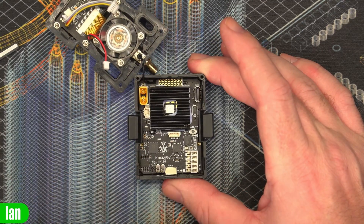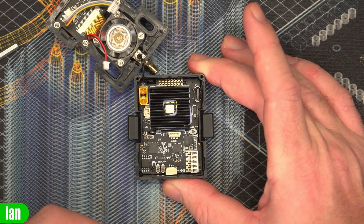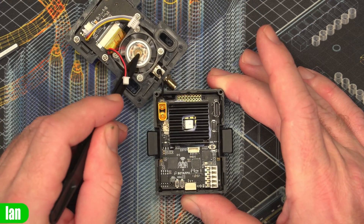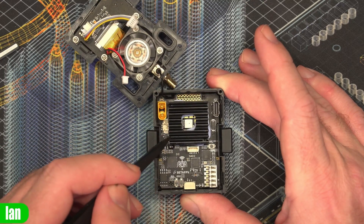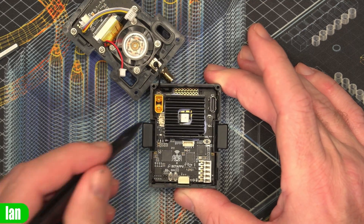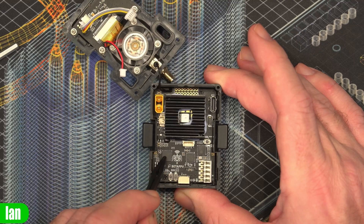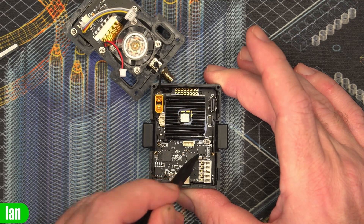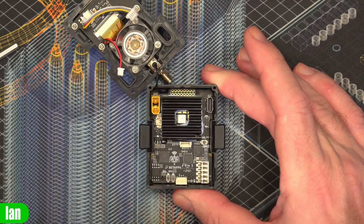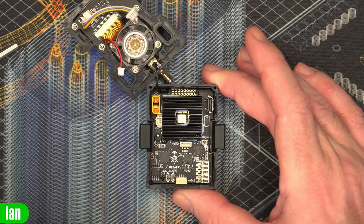The big difference on this module compared to the original is the large heatsink. Because it has up to one watt of output, they're having to get rid of additional heat, so they've mounted a heatsink on this side of the PCB. We still have a fan to move air through the casing, but this heatsink is what allows it to get rid of that additional heat. The overall PCB layout is different as well because we now have two ESP32 devices — a standard ESP32 and an ESP8285 for the backpack functionality. The little copper swirls are the antennas for Wi-Fi and for the backpack.